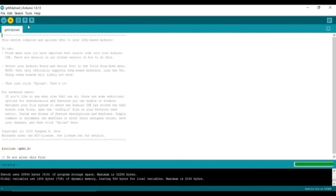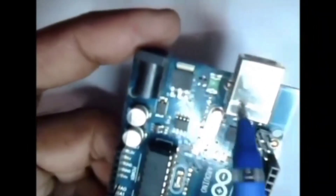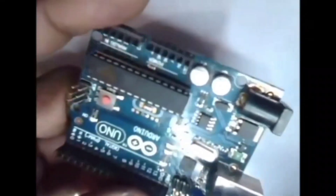After compiling, connect the Arduino. In Tools, select the port COM4 and board, then upload. Once uploading is done, move to Step 2. After installing the firmware, note that the USB UART IC — ATmega8U2 or ATmega16U2 — found on the Arduino UNO board behind the USB connector and above the crystal is the small SMD chip that provides USB functionality. When the firmware on this IC is corrupted, even if you connect the USB wire to the PC there will be no response. The LED may light up but there will be no response in the Device Manager.